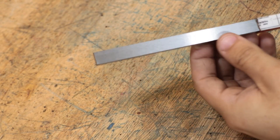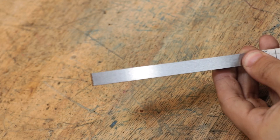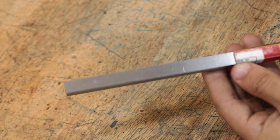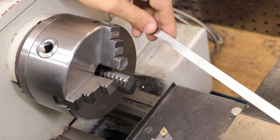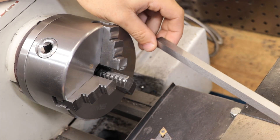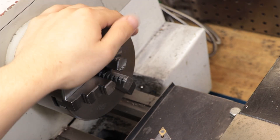What I have here is a piece of 10mm square O1 tool steel, which should be good enough for the job. It's in its annealed state, so we can machine it and then we can harden it. The first thing we need to do is machine in the cutting geometry on the lathe, and that's going to present us with another problem.